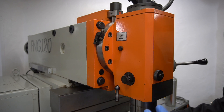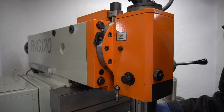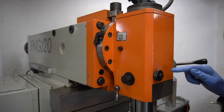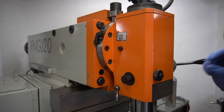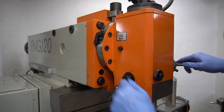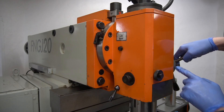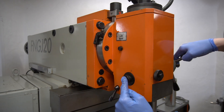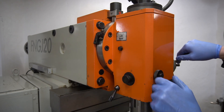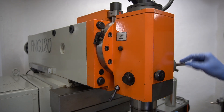Then you push up the quill, and if it won't match with the splines, just wiggle a little. Now it's up against the handle or the pinion rack. The brake is not 100% tight — it's a little bit loose. That way I can still move it but it won't spin by itself. As you can see, the quill rack or gear is engaged with the quill. The key is on the quill as well. Then it's time to loosen this quill handle brake and it should move up freely.